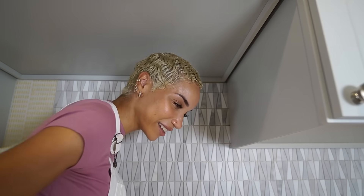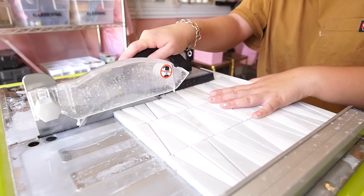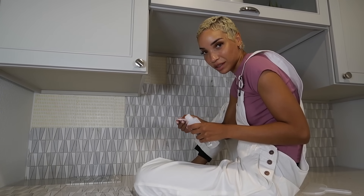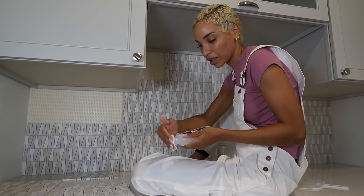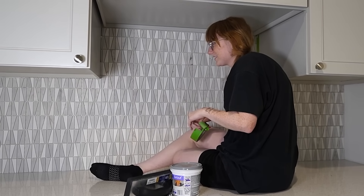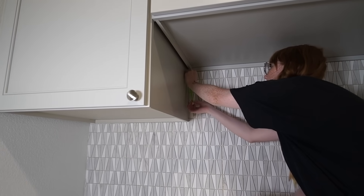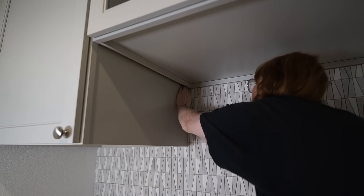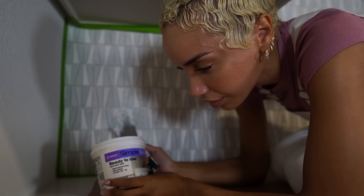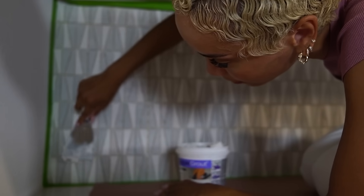I trained in Italy. I don't know what you're really supposed to use to make your markings on the tile, but we've been using a Sharpie, so I'm just using nail polish remover to remove the Sharpie marks. We've got to grout it next and that stuff's messy, regardless of how not messy it says it is, and we don't want it all over the cabinets. So we're going to do a little double layer of painter's tape next to it — this will come off before we caulk.